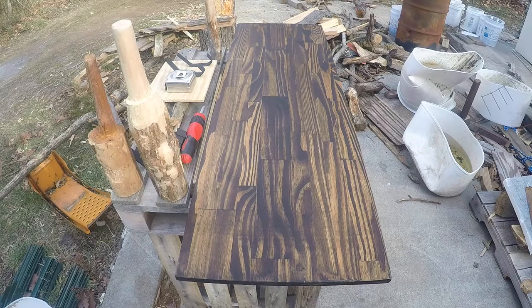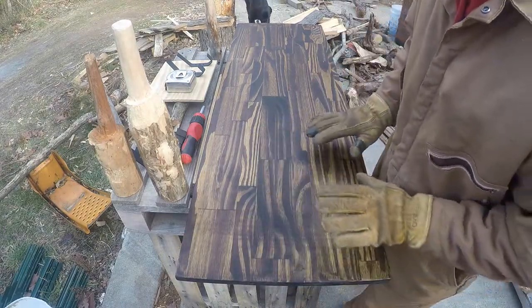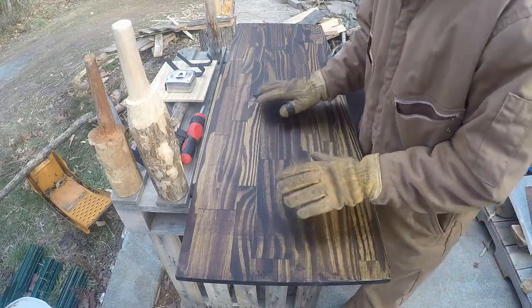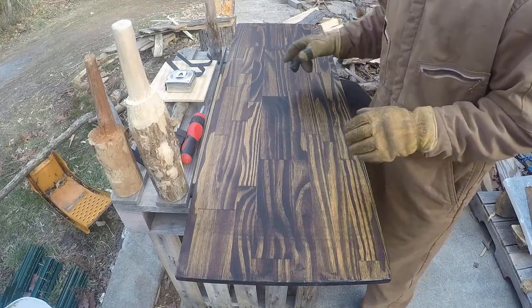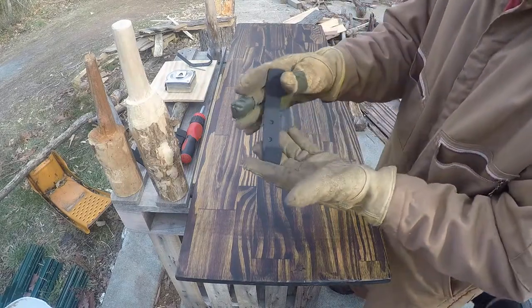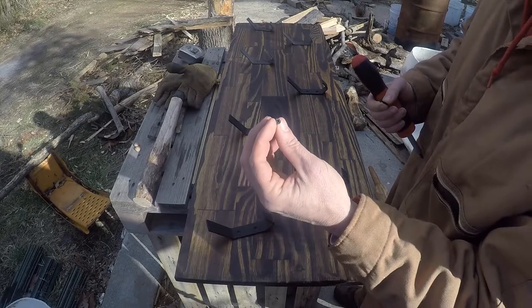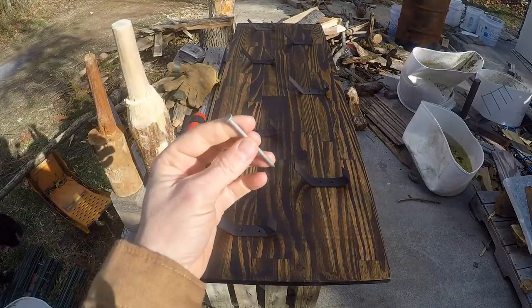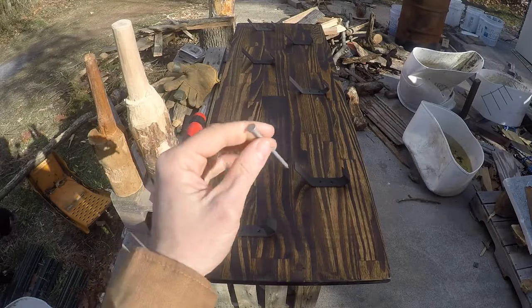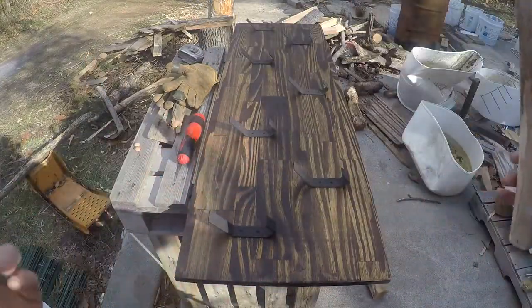It's done — I'm happy with it. I think it's three coats of linseed oil I ended up putting on, and that looks about right. I just took a nice clean rag and wiped it all down to get the excess off, and this is pretty much exactly what I was looking for — a little bit of a sheen but not too bright. Now I'll go about laying out the hooks, which turned out pretty nice with a matte black finish. I really don't want to use a drill for this if I don't have to, because it tends to mar up the inside of the painted edge too much. So I'll just use a regular nail as a punch to make sure my screw holes don't go crazy on me — just a stick and a nail, nothing fancy.